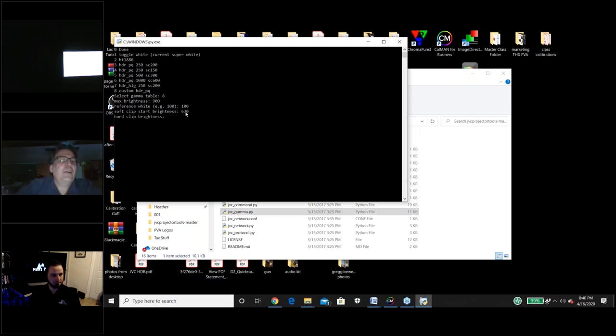Okay, and then we're going to hard clip at, we'll say, 4,000 nits. And then these are some numbers. You can play with them, but I just go clip and slope. We're going to use a slope of around 3. We're going to soft clip at 0. And we're going to clip gamma at 1.